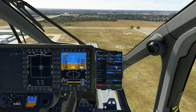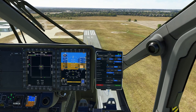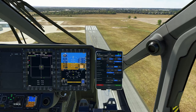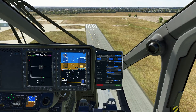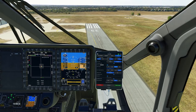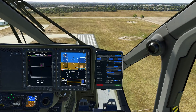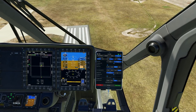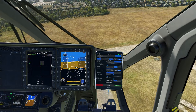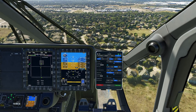Cruise is the same concept, except instead of allowing that input when you're under 30 knots to reset the new trim position for attitude hold, when you're under 30 knots it's going to ignore it — you need to press and hold trim release for it to reset the attitude when in cruise mode. If I was cruising at over 30 knots, I would be able to provide stick deflection and have it assume that new attitude as the new trim point.